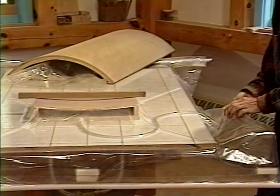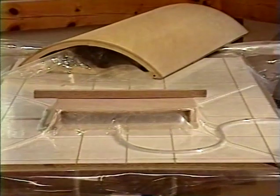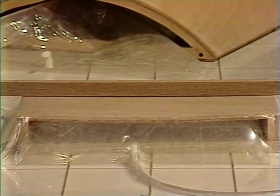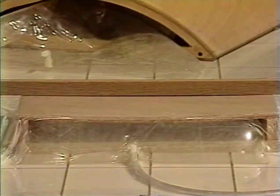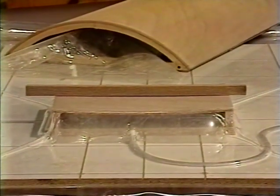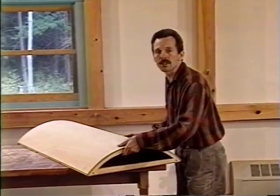The outside air rushes down the hose and into the AirForm, equalizing the pressure inside with the pressure outside the bag, bringing this particle board back to normal. The beauty of this technique is the greater the vacuum pressure on the outside, the more the AirForm automatically draws air in to balance the internal pressure. It's basic physics. A form that uses an AirForm would look like this.